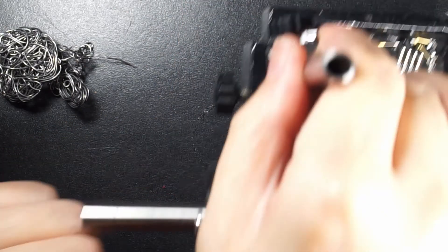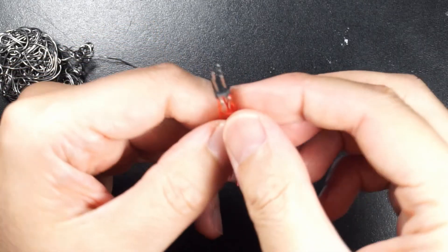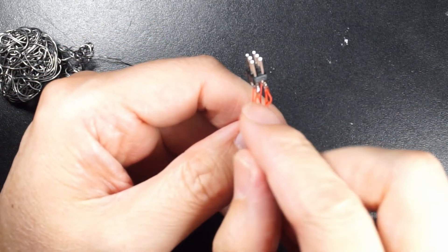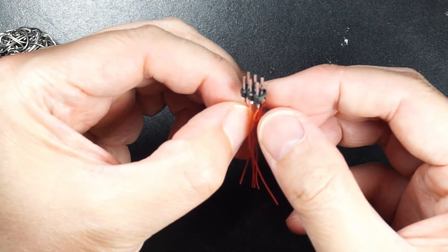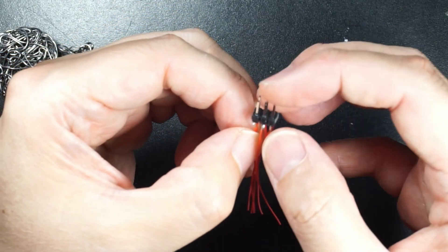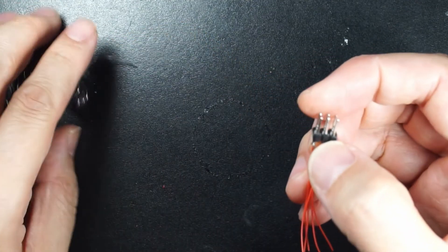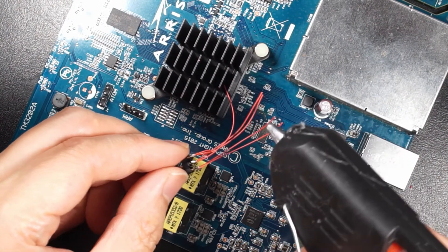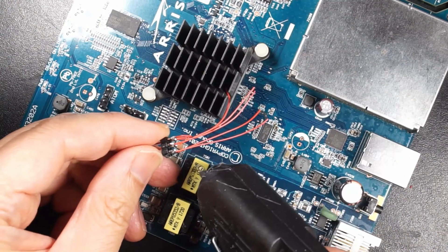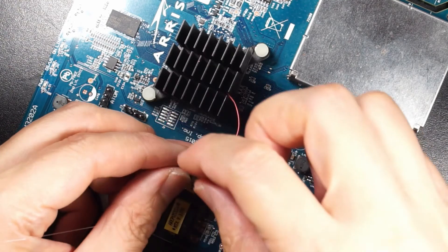I have soldered the six pins here with the two wires shorted. I'm going to use this side as power. This side will be data zero, one will be clock, and one will be command. We can glue the pin header here — I'm using hot glue to apply some here and then press down.